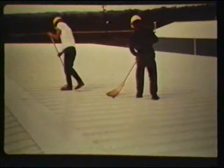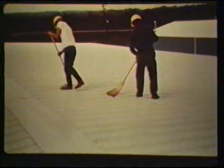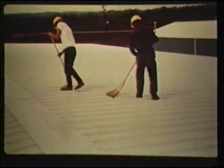Never apply a concentrated force to any single major corrugation for any reason. Use walkboards to distribute loads over 2 or more major corrugations. It is imperative that drill filings be swept from the roof at the end of each workday. Drill shavings, either from saw cuts or drilling and fastening operations, may become embedded in the roof coating. Within a matter of hours, rust can develop. This rust could eventually stain the wall finish, too.